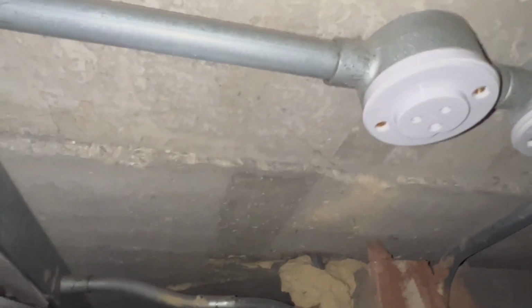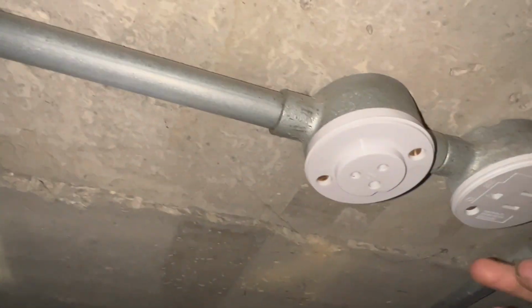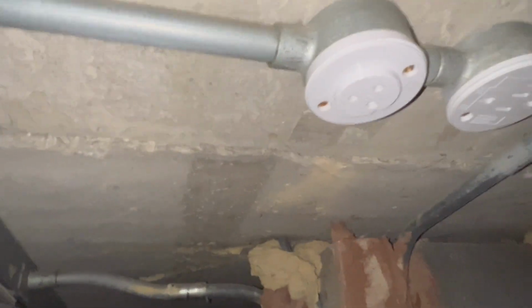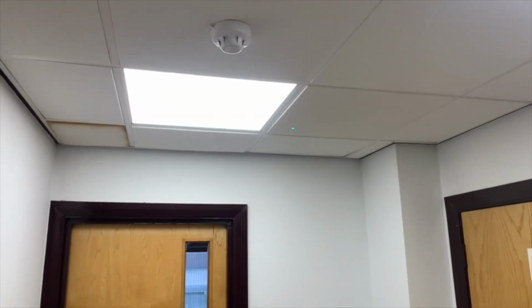Basically what we've got going on here is that you've got these 2 plugs here. That was the other one that was on there. But this one only had a live from the key switch. So what we had to do is link out the switch line from that one to that one. So then this right here goes on with the other ones. That's all sorted now, so that's all cut in, so that's the emergency. And that's all nice and sorted. Absolutely sweet.